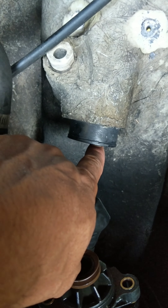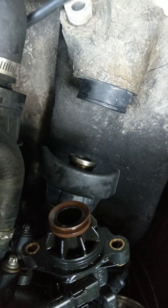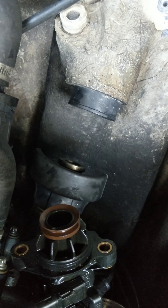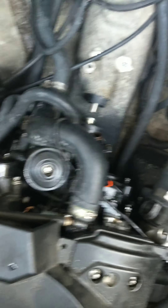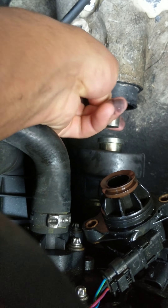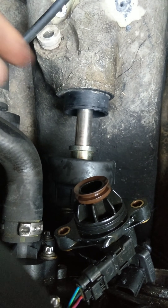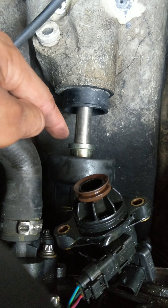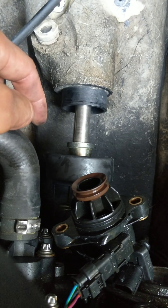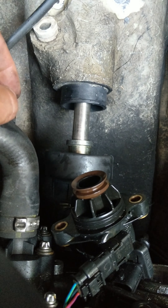It's back in there — it is touching the back of the PTO, and the drive shaft tool is inside the entrance to the boat where the bellow would be. The theory behind this is: when the drive shaft alignment tool meets the portion that goes into the PTO, it slides into the PTO portion. The shaft here, simulating your drive shaft, slides into the part that simulates the PTO alignment.